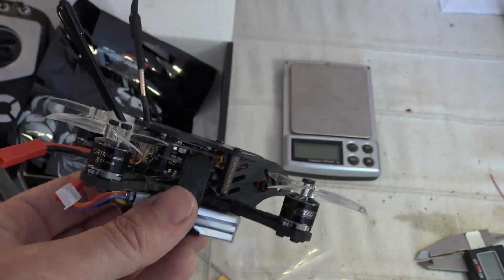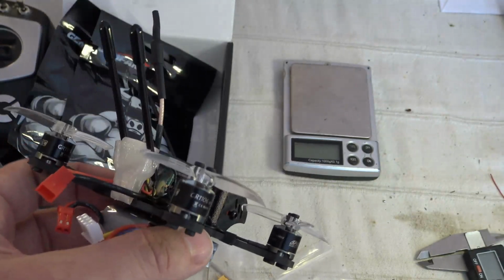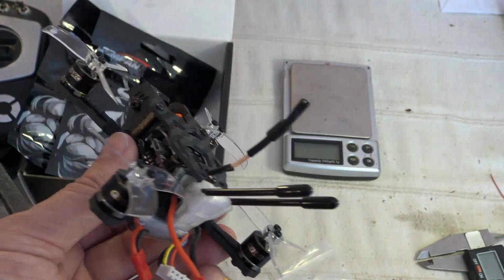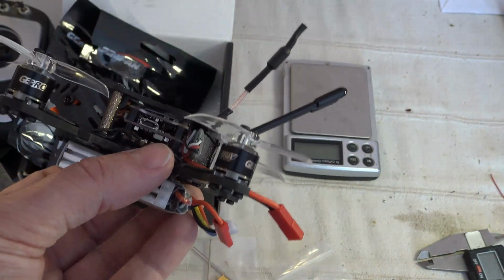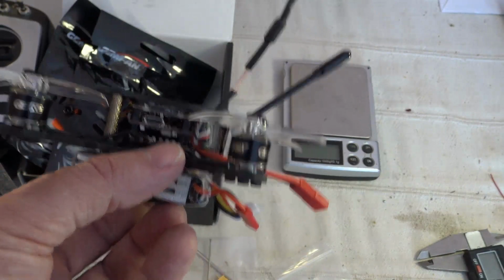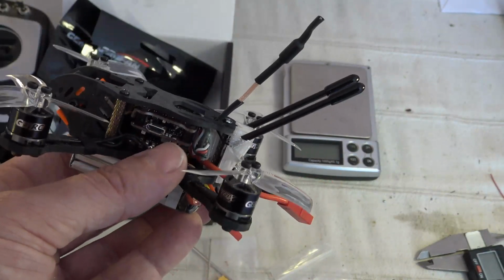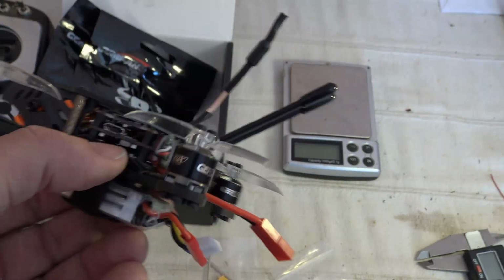And beware, out of the box, the firmware flashed is not exporting the RSSI. It's pretty bad for such an advanced micro FPV flyer to not have it. They didn't take 5 minutes or 3 minutes to flash the firmware of the FrSky XM Plus to export the RSSI. So for me it's a really negative point.